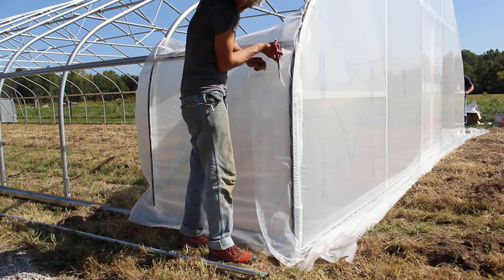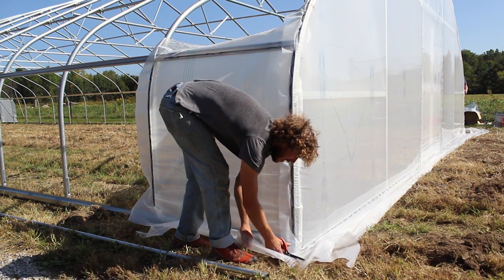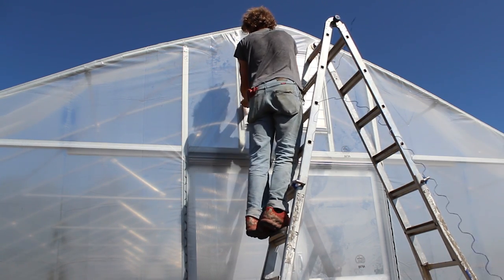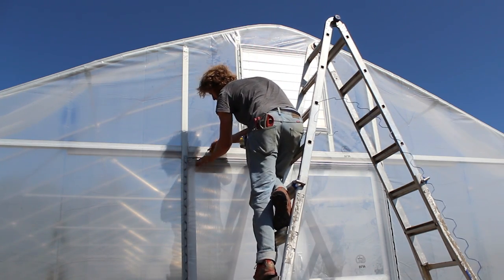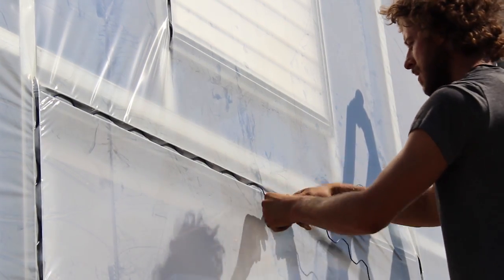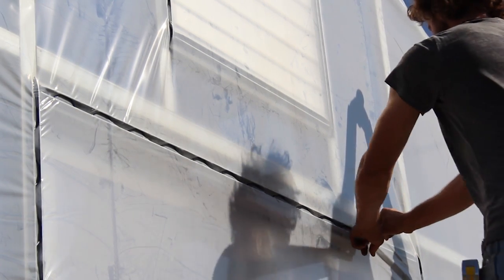Go ahead and trim some of that end wall plastic off. Leave a couple inches. Don't trim too close to the end wall. And there you have it. Whether you have shutters, fans, doors, what have you, this is the point in time at which I would wiggle wire around them. We have already secured wiggle wire on the vertical studs, but you can see here we're going above the door now. As I go back and forth with that piece of wire, we're going to finish it out.